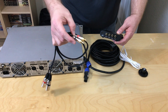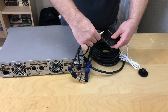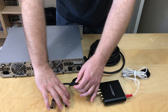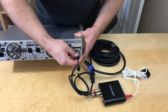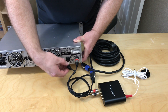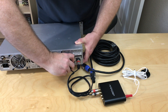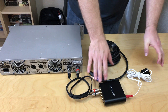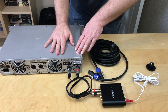Let's pretend we're going to connect two subwoofers. We'll take these two RCAs and plug into OUT1 and OUT2. Then we'll use the balanced inputs and plug these in to the inputs on the amplifier. One was red — let's call that channel A. You'll spin this thing around until you find the arrow at the top, and then it just clicks in. Then channel B, which is number two — spin it around until you find the arrow on top, push it in and it clicks. To remove it, simply pull out. So that's very straightforward on how to convert from RCA starting with your AVR, into your miniDSP, and then RCA from your miniDSP into the balanced inputs on your amplifier.